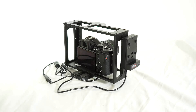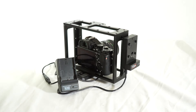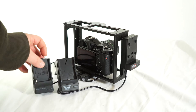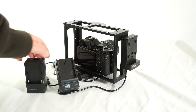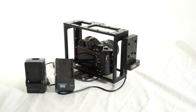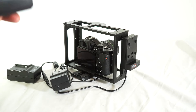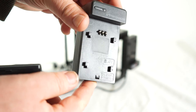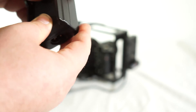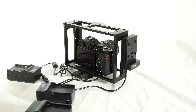What's attached to the side of the cage there is a battery charger. If you've ever bought cheap third-party batteries that came with a charger, or maybe just bought a cheap charger off eBay, you've probably gotten something that looks like these. These are pretty standard chargers — this one's for Sony camcorder batteries, this one's for Canon DSLR batteries, the LPE6. Here's one for Panasonic camcorders. They all look pretty much the same except for the part the battery goes into, and that's because they are the same. These are just plates that pop off and the charging base is the same in all of them. It says 8.4 volts, and all these camera batteries are more or less between 7.2 and 8.4 volts and can all be charged the same way.